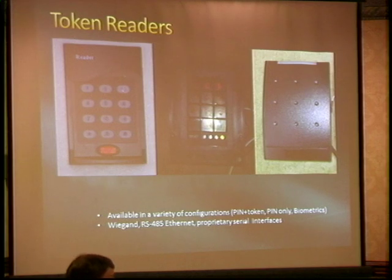If you buy all gear from the same ecosystem and vendor, they do have an encrypted protocol — maybe even a public key exchange or three-way handshake — so you can't plug in a rogue reader device. But the second it has to interact with a fire alarm or a building control system that's been there for five years, it's almost always going to fall back to one of these clear-text modes, or go through a gateway that talks encrypted AES on one side and dumb Wiegand signals on the other. Definitely vulnerable to interception at those points.